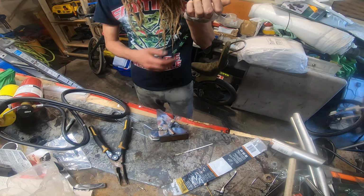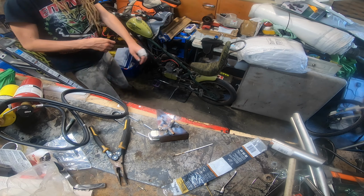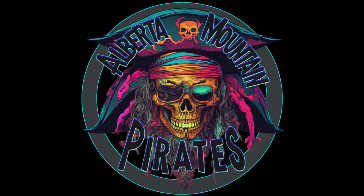That pretty much wraps up this quick video here today. I just kind of wanted to show you some of the stuff I'm experimenting with, and this didn't work perfectly, but that's mostly due to the brazing not being totally perfect. So if I go back in there, run over it again, give it some more braze, I think it'll be really, really good. It does work as it is, and we have been using it, but it does leak a few drops here and there right out of where the little holes in the braze are.